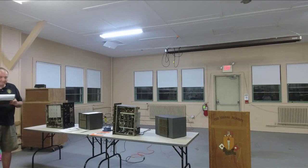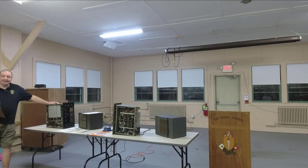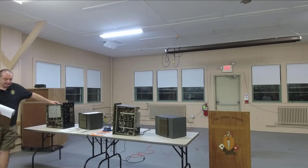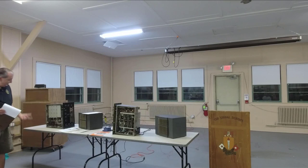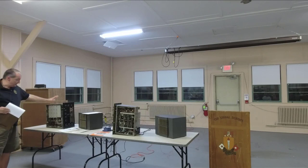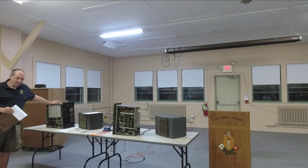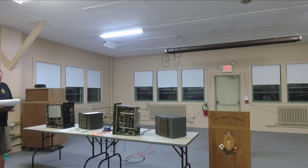I don't know if you're... I'm not familiar with the radio, if you somehow take the gain down. I thought about backing the RF gain off, and this was just a little while ago. I was fussing around with them. But it certainly tunes slowly enough that you probably could do acceptable sideband copy.